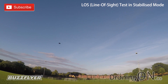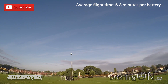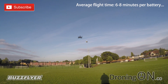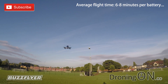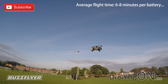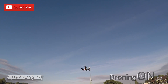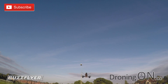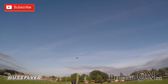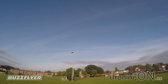We've got the battery warning beep again. I'm not sure how long we've been flying but we can check the video — I think it's probably just over six minutes. You can hear the battery beeping indicating low battery, and the rear right-hand LED is flashing red to let you know the battery is running low. Never fly for much longer after you get the beeping because you don't want to damage your batteries, so we'll land at this point. It's actually a shame to land — I'm having a great time, but anyway.